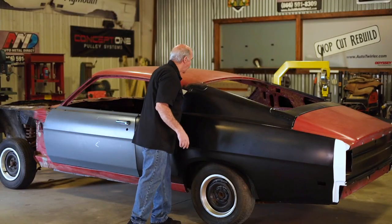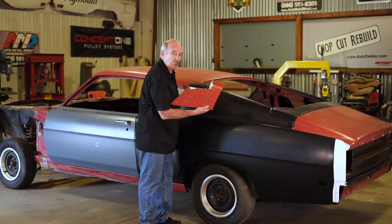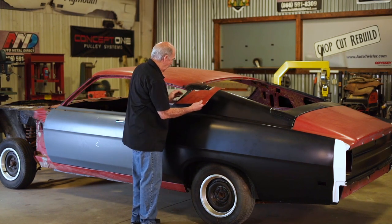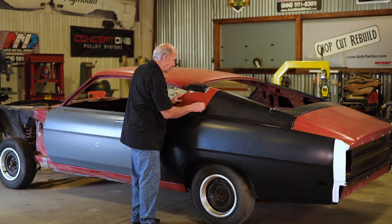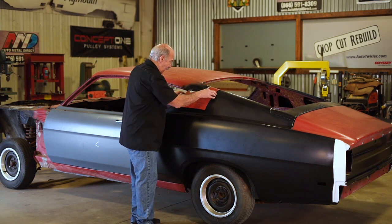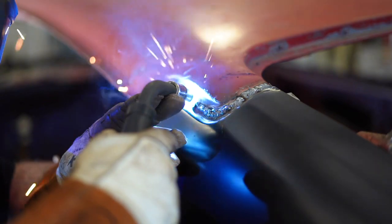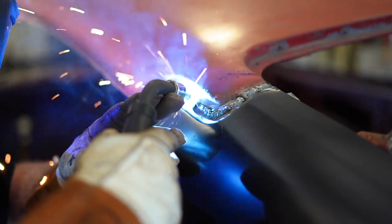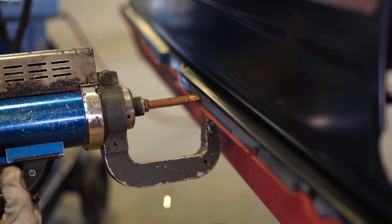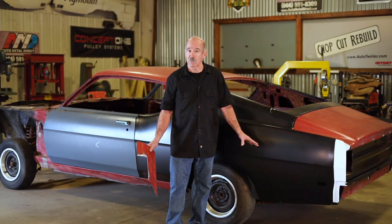We also saved a little panel for the trim and I aligned it to the front and the top, so you'll know exactly where you're going to put the screws. You saw how we put the roof joints together and spot-welded the rest of the car together. It really is a matter of just fitting everything before you weld the car together.